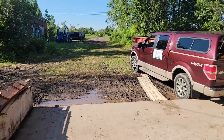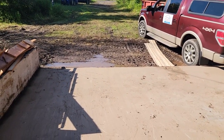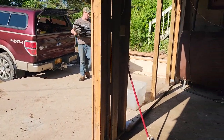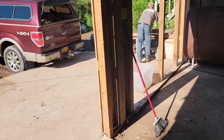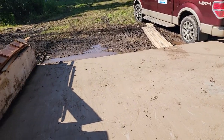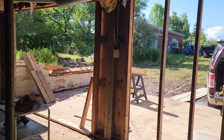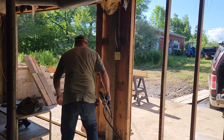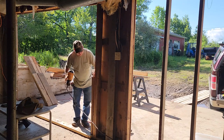Alright, we're at the next day. It's nice out, except it's hot. We got a little rain yesterday. We're going to frame in this wall today and get some OSB on here and see how far we get. I'm going to use up some of the leftover pieces wherever they can work. I tightened up the half-inch nuts on those sleeve anchors.